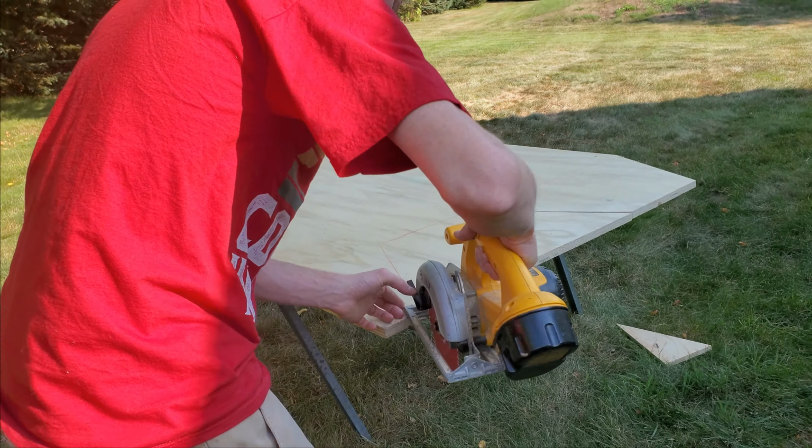Now this isn't necessary for marine grade plywood, but I really wanted just an extra layer of waterproofing on this because part of it probably is gonna sit a little bit below the waterline. I added a little bit of mineral spirits to the varnish to thin it out so it absorbs farther into the wood. This just means that we're gonna have to have a few more coats. So I'm gonna go back and forth while I'm painting the trim and adding another coat of varnish to this, and I did this about 3 times.